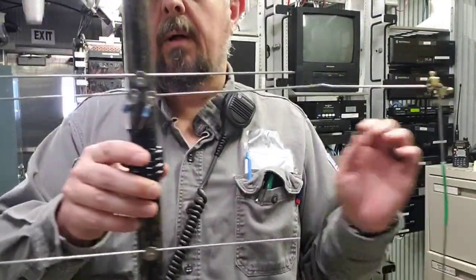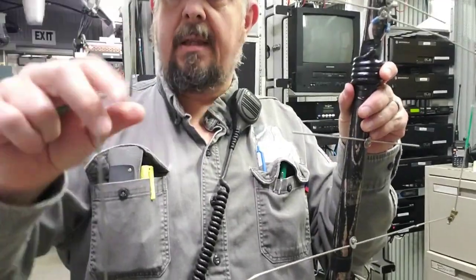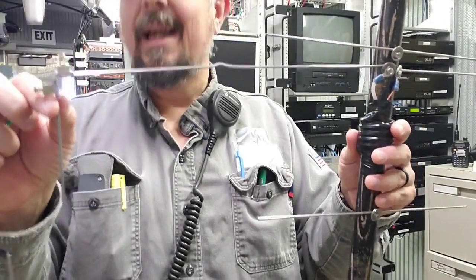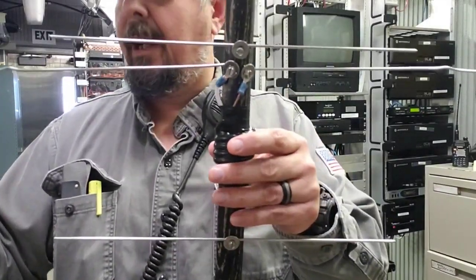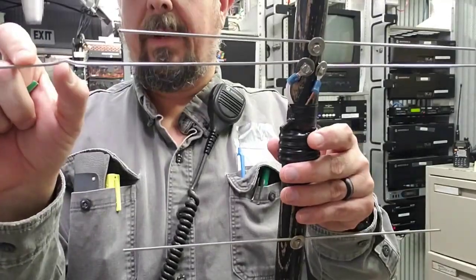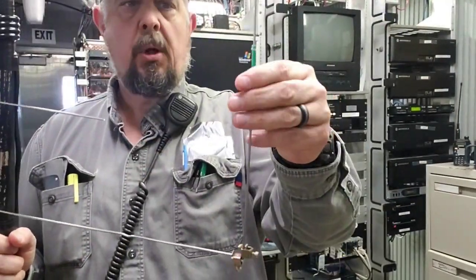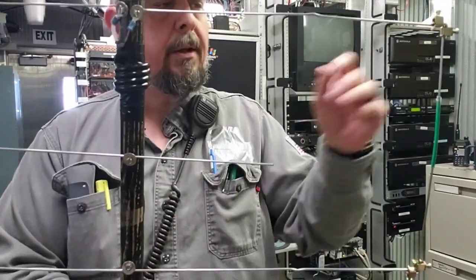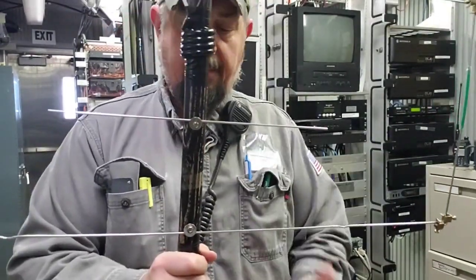This thing is really no more than a folded dipole. That's nothing but an air gap there. This connector here is because of my screw-up — I cut my radials too short and had to add to them. If you look right here, that's where I folded this over, because that's all you have to do. It's TIG welding wire. So if you cut this thing the right length, you can just fold it and bend it. This thing is a folded dipole with a reflector on it. This air gap creates a capacitor, so your dipole and your reflector are coupled capacitively to give it some forward gain and some rejection from the bottom.